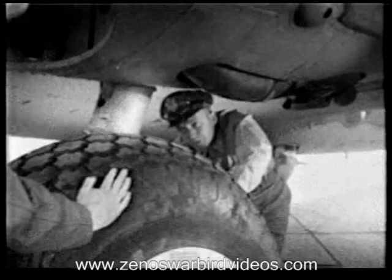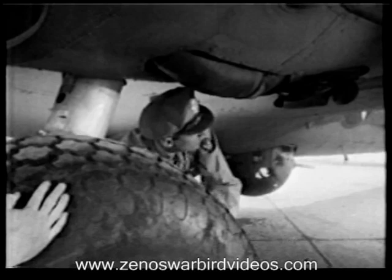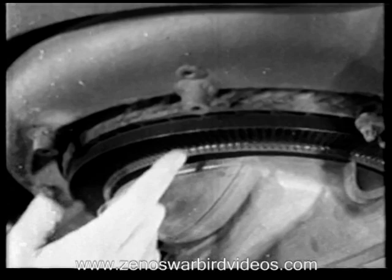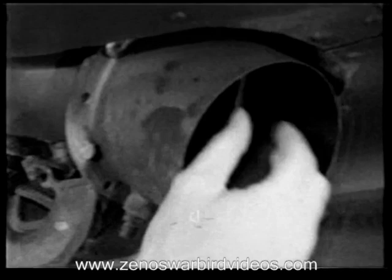When you're finished with this left-hand gear, examine the turbo wheel on this engine. Look for cracks, especially at the welded joints. Check the wheel itself for clearance, 3/32 of an inch all the way around, and turn the wheel to check balance. Watch for broken or missing buckets in the wheel as you turn it. It doesn't hurt to check the mechanical linkage on the wastegate either.